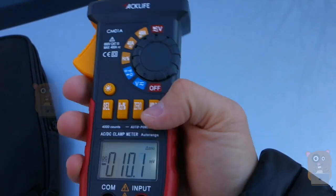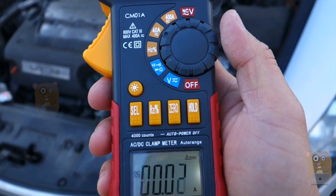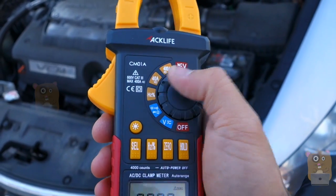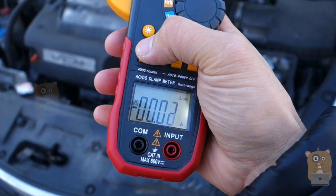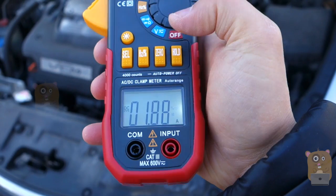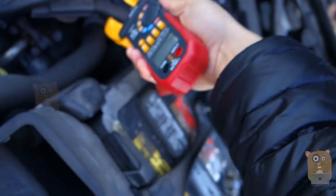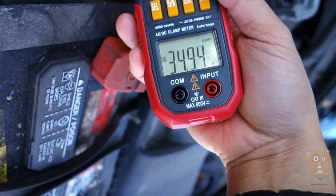This is very useful for home use, DIY, or auto repair. I'm going to demonstrate the clamp meter. For this vehicle, I know I don't have 400 amps running — it's just 40 amps. I can also set it to zero and measure DC. If I want to change from AC to DC, just press the select button. After zeroing it out, it's reading about 34 amps.